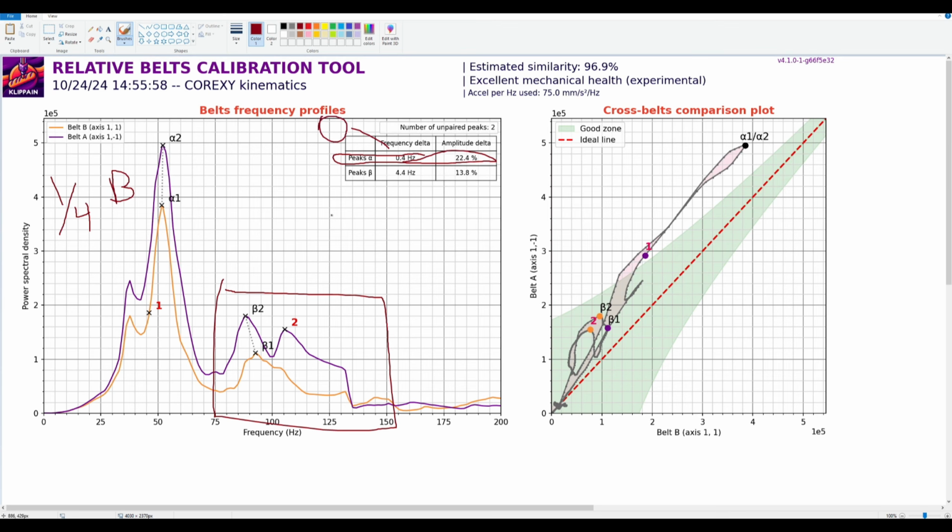There's going to be a delta. On something like this, there's always going to be an amplitude delta, but we want the frequency delta to be zero. And then after that happens, we'll take a look at this, and we'll run the X and Y input shaper. And we'll see if there's some sort of ghost, some sort of fingerprint on your XY input shapers, to determine if this is a problem.